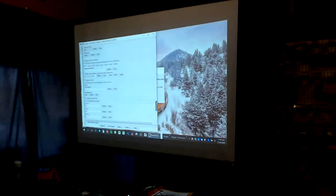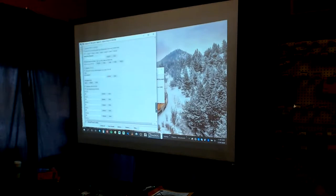If you guys are into prototype railroads, there's something called track circuits. Basically, track circuits convey the signal indication down to the next signal. It's all built in here. So if you just want to look at whatever the next signal is, this is already built in. And as if they haven't thought of everything already, you can actually set the individual lamp intensities. You know, let's say that your green's too bright and your red's too dim. You can go through and tweak your, you can see how I put in different numbers here, because the greens on these were just obscenely bright. And you can actually configure real time how bright they are.